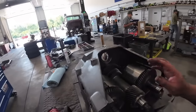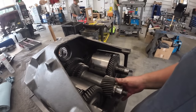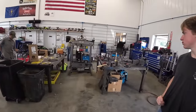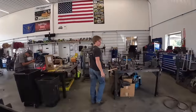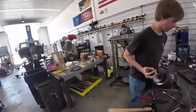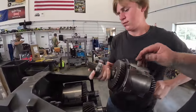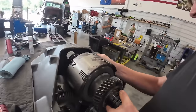All right, we got the main input shaft stuck in here off camera. You guys seen us take that apart, but we're about ready to, where'd our other, that clutch pack over there? Bearing goes in it. It's heavy, so. Bearing goes in towards the case. That's the last one we just rebuilt. And watch your fingers. Oh, you can do it.